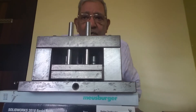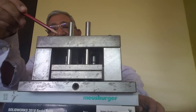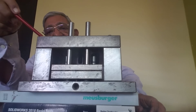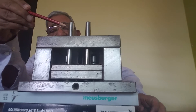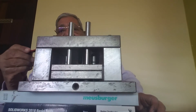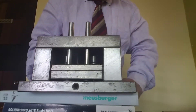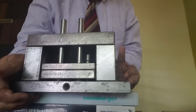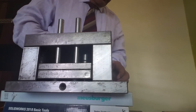This is the core back plate. It has been aligned — not assembled. It is aligned with the support block through tubular dowel. The return pin passes through this as well as the socket head cap screws.